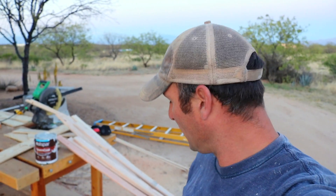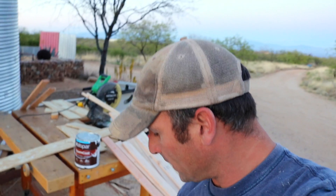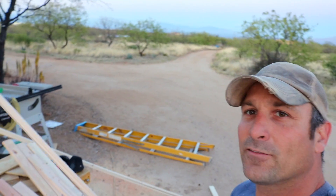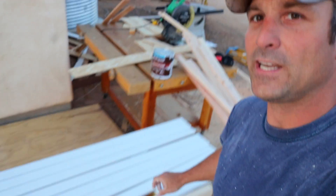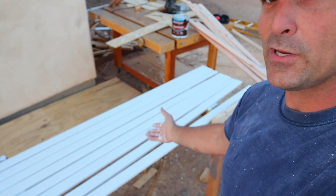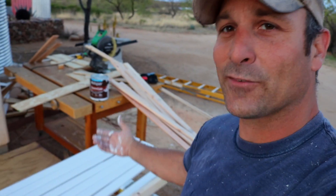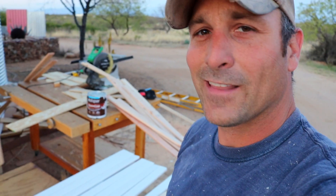You just saw me doing the finish sanding of the drywall — all of the joints are mudded and it's pretty much ready for paint and trim pieces. I didn't want to spend a ton of money on trim pieces, so what I'm doing is ripping two-by-threes in half to create two separate halves of a baseboard trim piece look, and then painting them white right here — essentially making a trim piece for about a buck minus my paint and labor. It's a lot cheaper than what you can buy at the store.